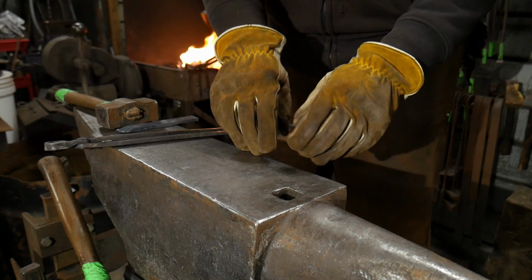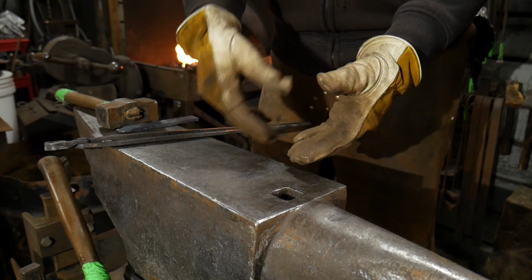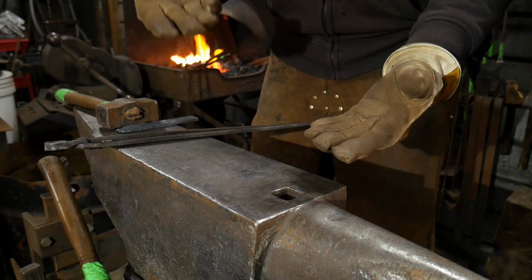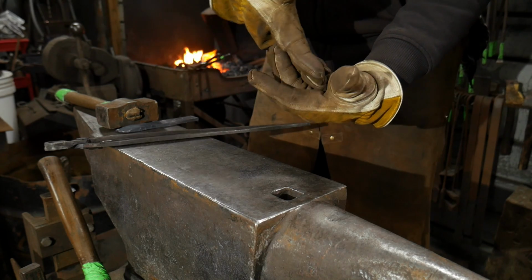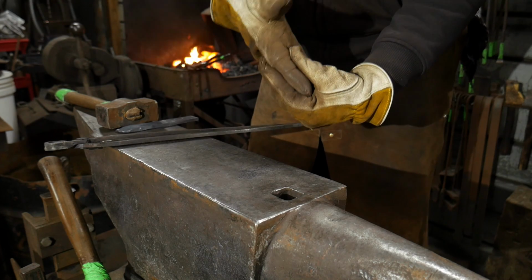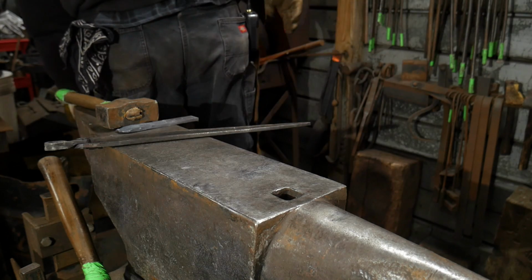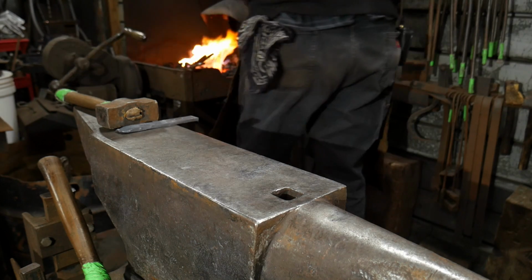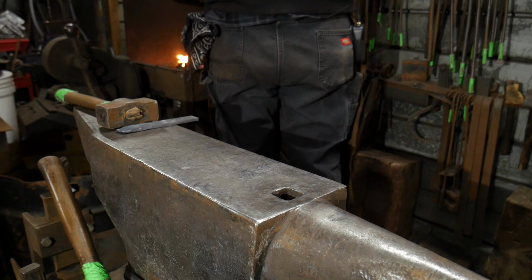As where when we did the example of the T-weld, which I'll link in the description down below, that T-weld that we did, that layering over, it's only on one welding plane. This pocket weld, you have two. It's like a taco. You're getting one welding plane here, you've got a welding plane here, and then you've got a welding plane here. So all those are in welding planes, and so you get three different joints basically that are being created, which is a great thing for structural capabilities, as it were.